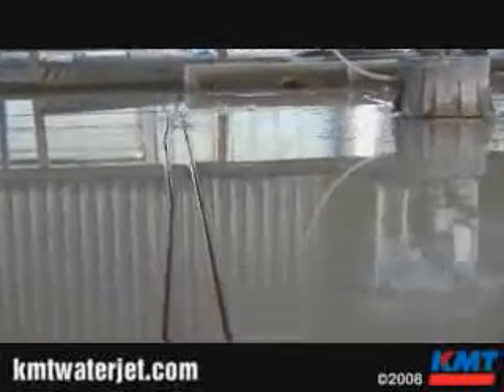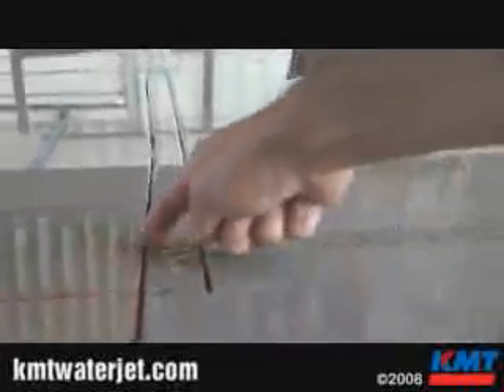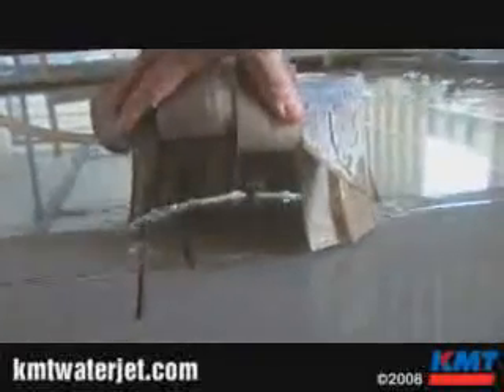Now you can see where it's going to go back along the backside and scribe this wall. You can actually see where the saw has come down and plunged in a series of straight lines. The waterjet's now going to come in and clean up all that and connect the dots — that's where you can actually see the bow that's in these people's wall of their house. The saw knows exactly how far to go without hitting the adjacent piece, and the waterjet punches just as much as necessary to remove the curve from the blade.